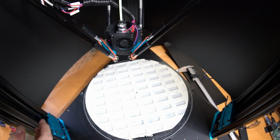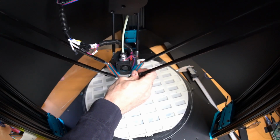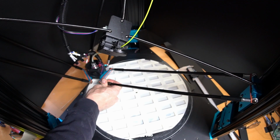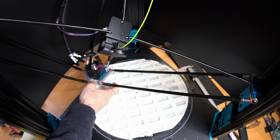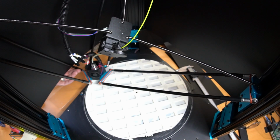When you do put your enclosure on, it's actually important to leave some space down here because this hot end, when it goes to the 370 millimeter edge, can push beyond this side panel if it were not bowed out and if it didn't have a gap at the bottom. So the 20 by 30 inch panels are actually perfect because they have the right amount of gap.